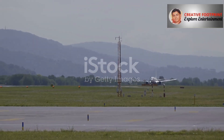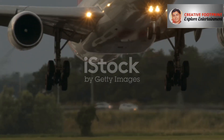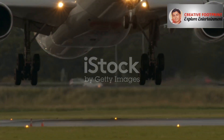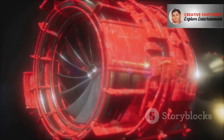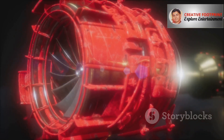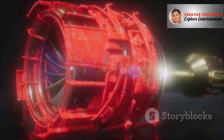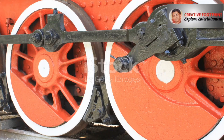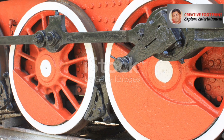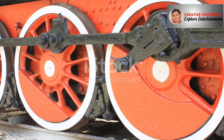The aerospace industry is where forging truly reigns supreme. A modern passenger jet is a collection of some of the most advanced forged components on Earth. The landing gear, which has to absorb the impact of a multi-hundred-ton aircraft hitting the runway, is forged from high-strength steel or titanium alloys. The massive turbine discs inside the jet engines, which spin at tens of thousands of RPM in an incredibly hot environment, are forged. In space, there are no tow trucks — we don't use parts that might fail; we use parts that we know won't. The railway industry also uses a mix: cast iron for brake blocks, while wheels and axles that bear the immense load are typically forged for maximum strength and safety.